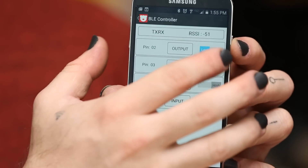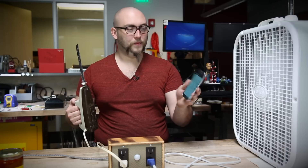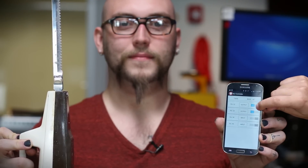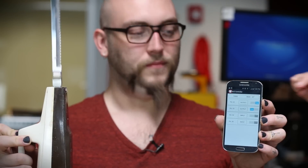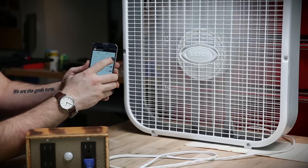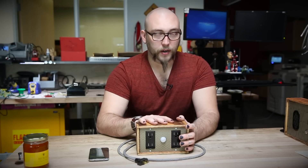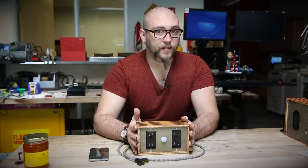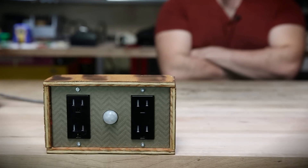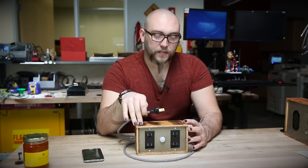I've plugged our demo into the wall and connected a couple of devices to it that you might want to control remotely, such as a box fan and an electric carving knife. You can see that I have a control panel on my cell phone, and if I press this button, the fan turns on, and I can turn the fan off again. Same goes for the carving knife. This is actually a pretty straightforward project — I used some example code that RedBear Labs provided that lets you control the digital inputs and outputs on their board using an app you can download from either the iOS or Android market. I'm using an Android device, so I just downloaded their software, loaded the example sketch from the Arduino library, and then wired up some of the digital outputs to a couple of our solid-state relays. The solid-state relays are just interrupting the power connection from this cable to these outlets. I also tapped into this power line and connected it to the board out of one of our wall wart power supplies, so I could supply the DC voltage that the RedBear needs to run, as well as the AC voltage that I'm using to control these devices.